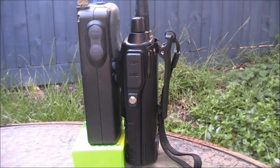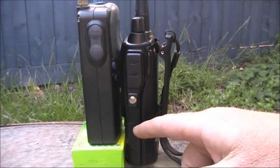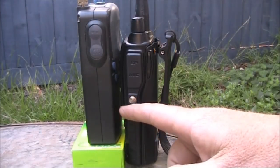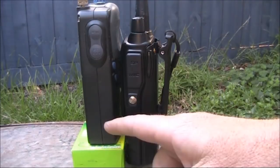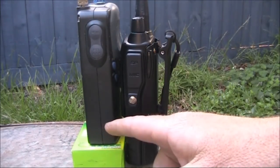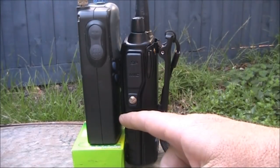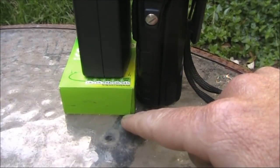Here's how it's done. On the left is a receiver tuned to 434 MHz. On the right is a transmitter. Remember, the VOX is enabled, as is the 15-second time-out. Because the VOX can be fairly insensitive, you do need the speaker of the receiver hard up against the microphone of the transmitter as much as you can manage it. In my case, a box of Sultanas helped.